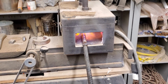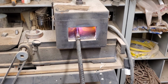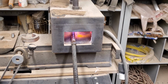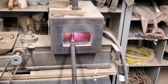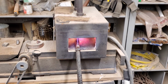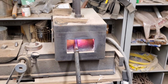I've made a few of that style before, but never with a hand-forged blade. I've made one out of Damascus and a couple out of a high carbon steel. This W2 is some famous steel that I've told the story on in other videos, so I probably won't talk about it here, but it is an excellent steel that holds an extremely good edge and has a very vivid hamon. And that's what I'll be doing on this knife, is it will have a hamon. So I'm going to document the process, not in extreme depth, but just let you see the steps that go into making a knife like this.